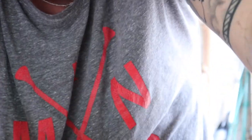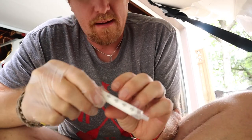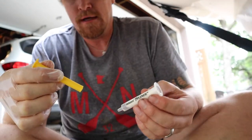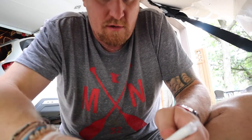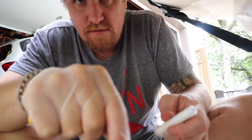Hey guys, we're sitting down under the back of the boat. I took the 5200 and put it in a Tylenol cap — if you're a parent you probably have about 70 of these sitting around the house — just to make it a little easier when prepping the surface. I'm going to go around the edge of the drain plug hole and also on the back of the assembly, then we'll drill our screws in for the drain plug.